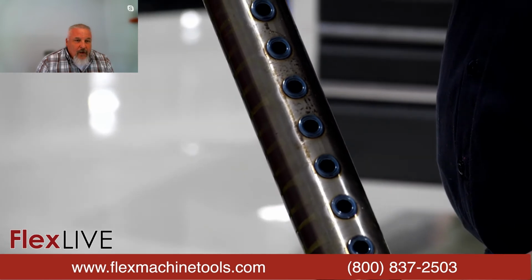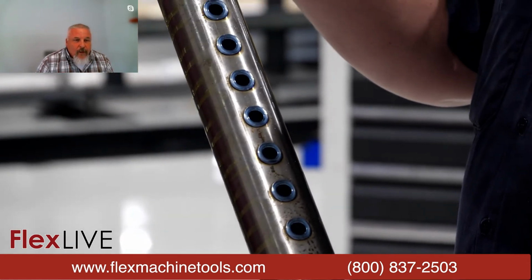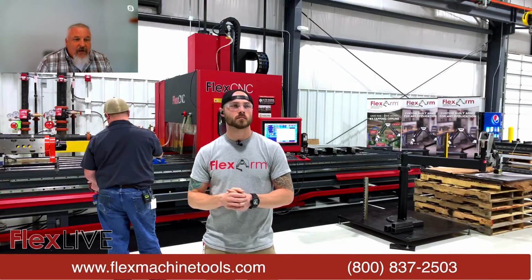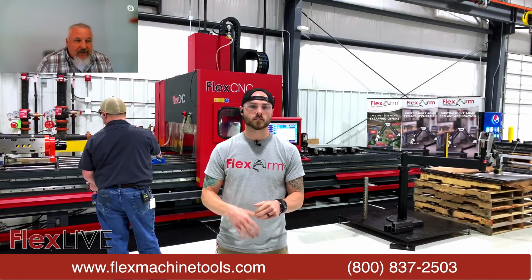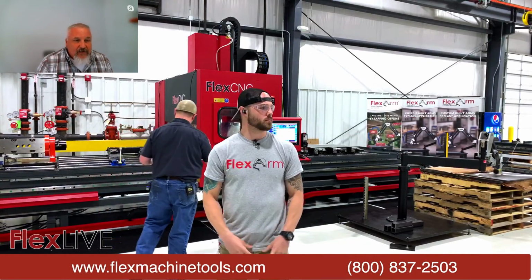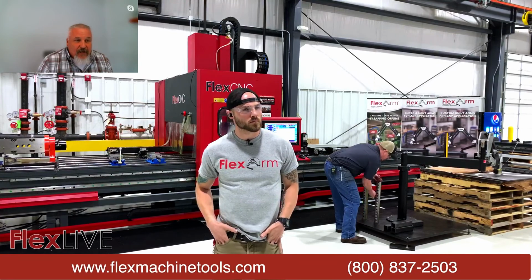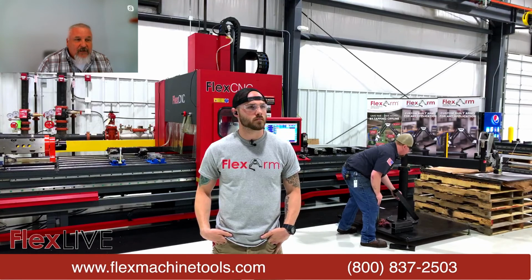Why would a customer want to leave that collar instead of shearing that collar off? On round tubing, we typically always use the standard, just because if we try to use the flat style, we can only come down tangent to that top surface, and it leaves a little sharp edge on either side. So on round tubing, it's a standard method to use the standard tool. The advantages would be a little extra length in the overall thread length, so you get that additional little bit of thread on the top surface.